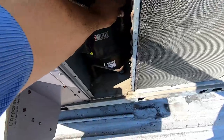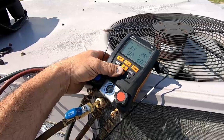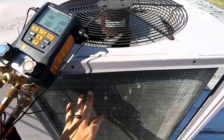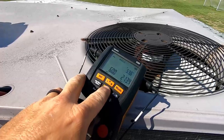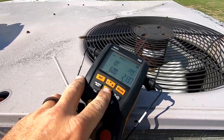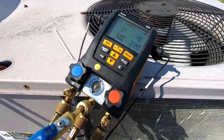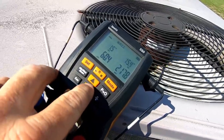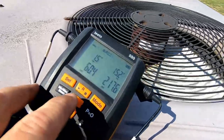Let's check this charge out. Cold - we're good. Checking our superheat. This is an orifice system, not a TXV, so we're going to check that. Coil's a little bit dirty on that second piece. Superheat's way too low, so it's overcharged. Coil's probably dirty - quite a bit of heat load down there. We should have a higher suction.